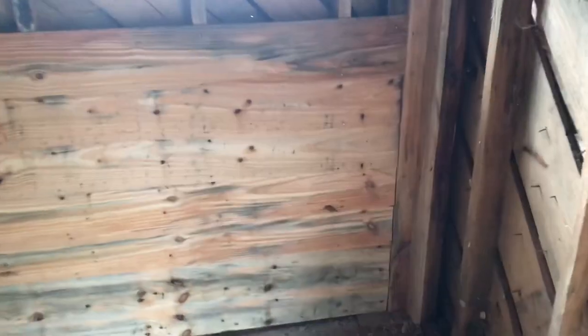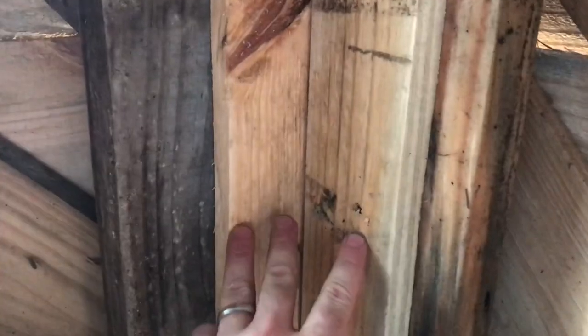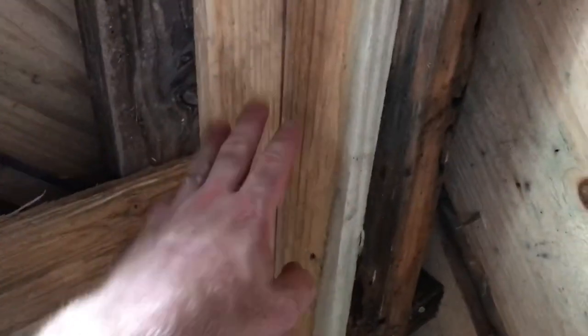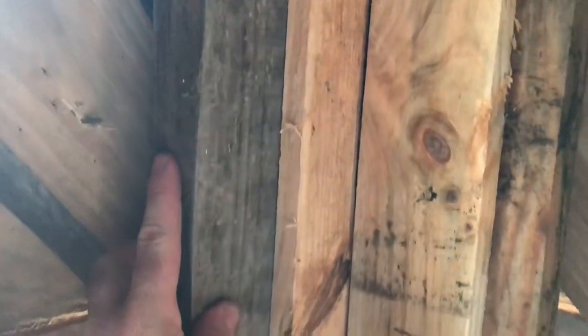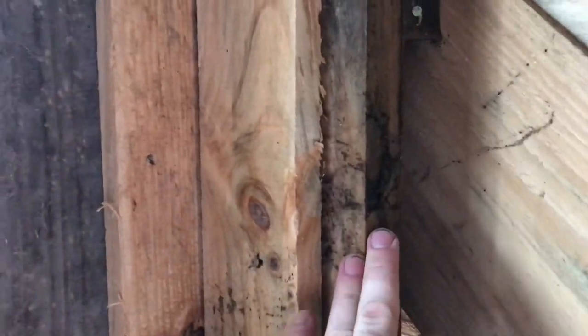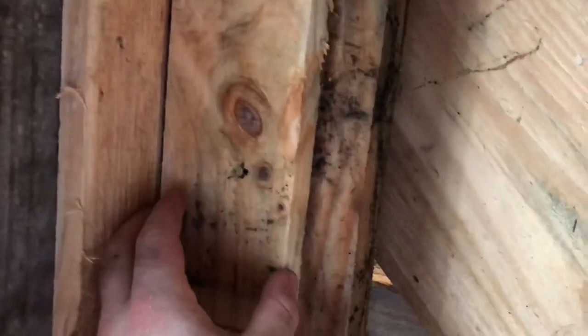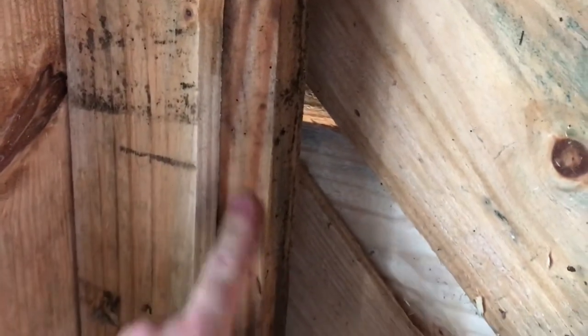Anyway, because we wanted to do corner trim just like we did on the exterior, there's two pieces of 1x4 here that are butted together. You can see obviously this one overlaps that one, so this looks like a 1x3, but that's okay. I could have cut this one bigger to make it look even, but it just doesn't really matter. We wanted to have that same corner trim and butt joint look like we had on the outside. To do that, I had to add framing right here in the wall. So I took a 2x4 and here's a 2x6 that I had already cut. I managed to use the scrap to do it and just blocked this out a little bit. So there's a little spacer block in there that fills that gap, ties it to the exterior wall, so that's solid. I did that on each corner. I framed in the corners enough that you can put your 1x4 on and still have a strip to nail to with the siding. So I had to do that all the way around.